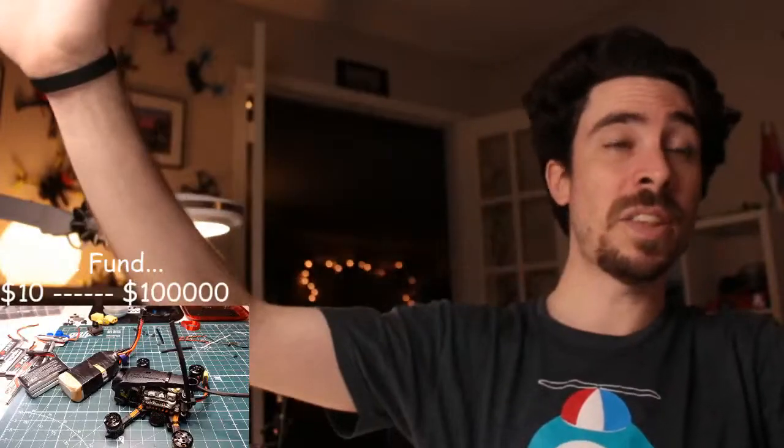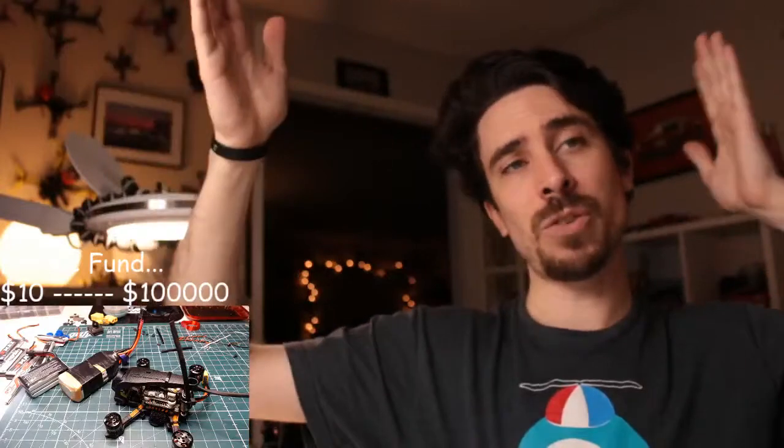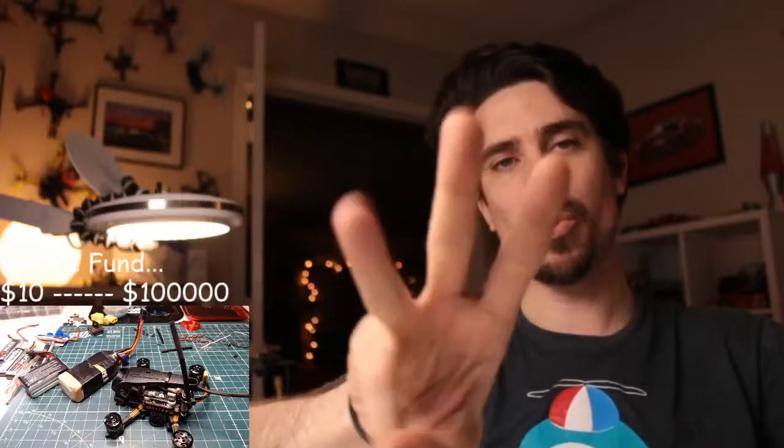I would go get Gemfan 3052s, just so that you have the most pitchy possible, one end of the spectrum that's the most pitchy but still a beautifully well balanced prop. Then get Gemfan Wind Dancer 3028s. That's going to represent the other side of the spectrum, and in the middle I would maybe get the T-Motor 3140s. Yeah, so do that. Get those three and see which ones you like best. T-Motor 3140s, Gemfan 3052s, Gemfan 3028s. This way you'll figure out, do you like low pitch, middle pitch, or high pitch?